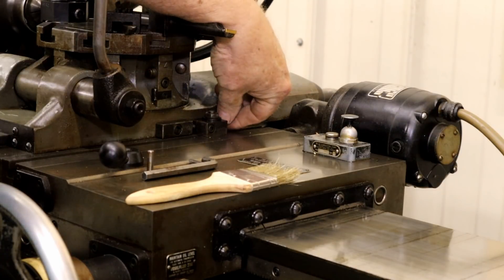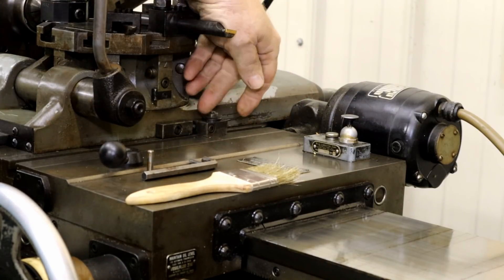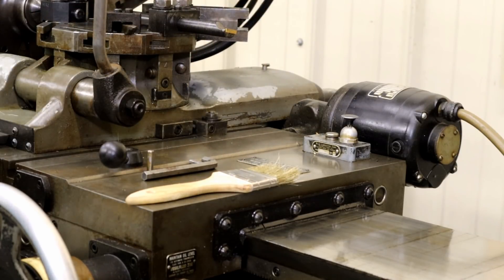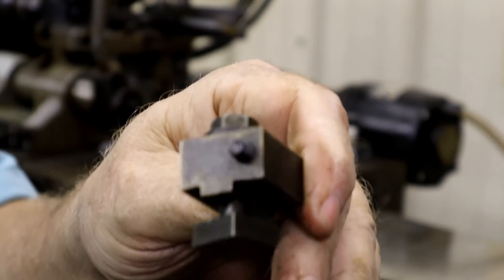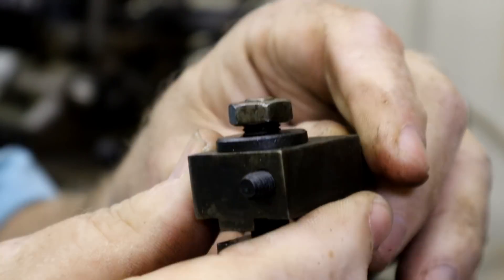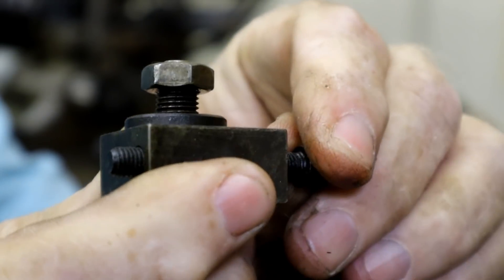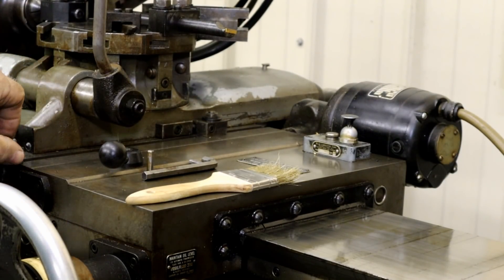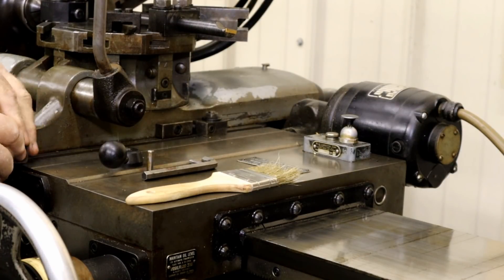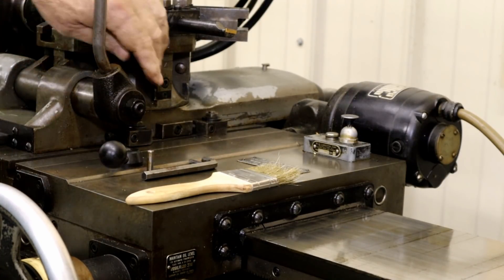What I've done is this can no longer go any farther back. There's a little Allen screw that you can adjust for precision. There's also another one that is bored — see that little precision adjustment? You do the gross adjustment with the T-nut, and then you can fine-tune it with the Allen screw. This one is designed to fit on this side so you can also install it as a positive stop for the part you're making — you want it to be so far this way, and it'll adjust on either side of this permanent block.